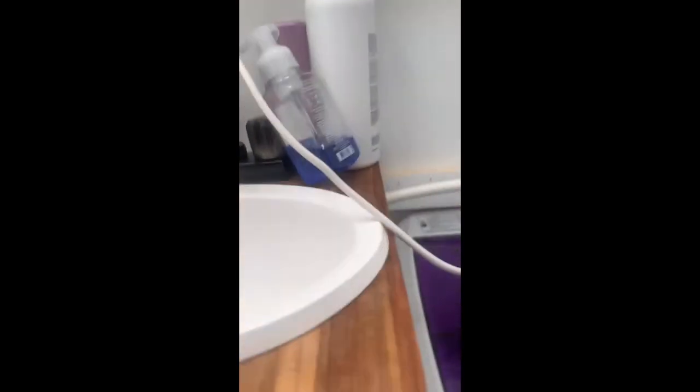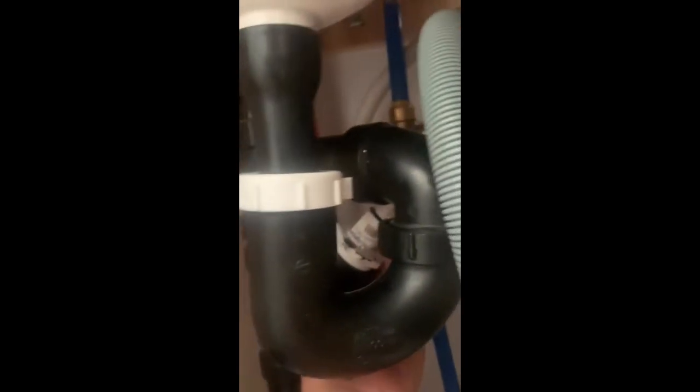I'm very pleased with the way it's draining — it's draining right now. Basically what I did is I added a tee to the sink drain, then found a fitting to convert it to a threaded piece that had a gluing half-inch piece of PVC pipe. From that piece of PVC pipe, I was able to hose-clamp the drain hose on, and it seems to be working pretty good.